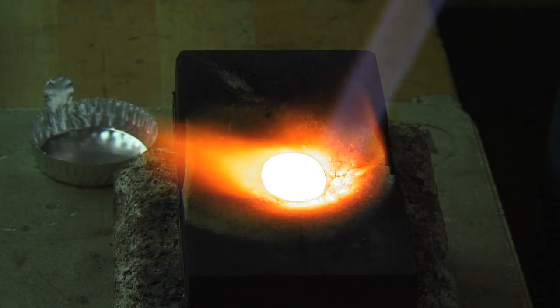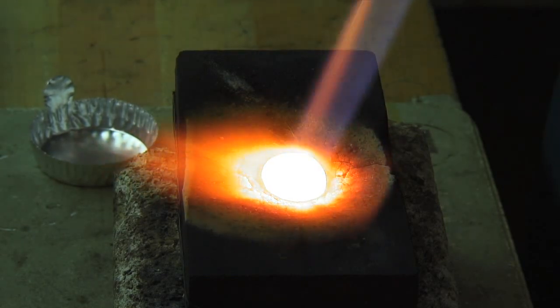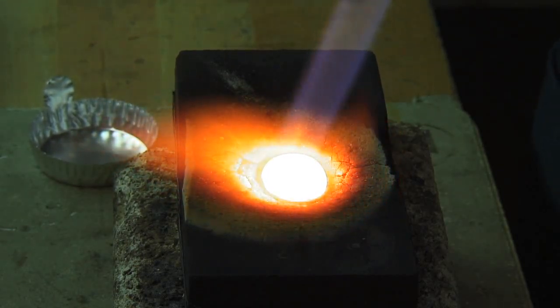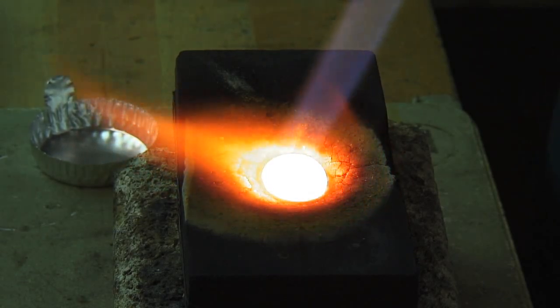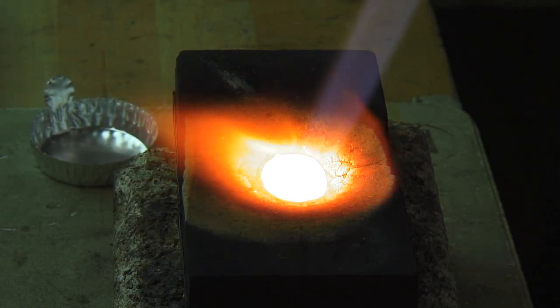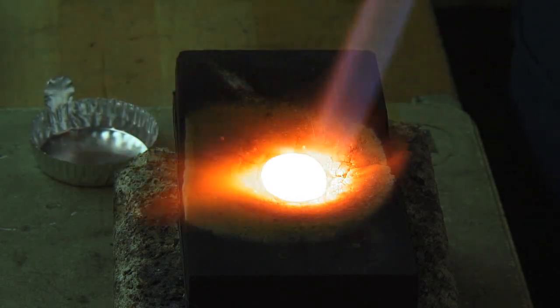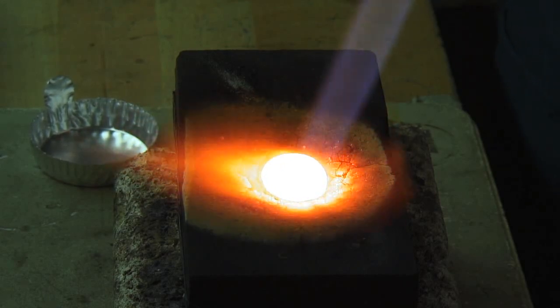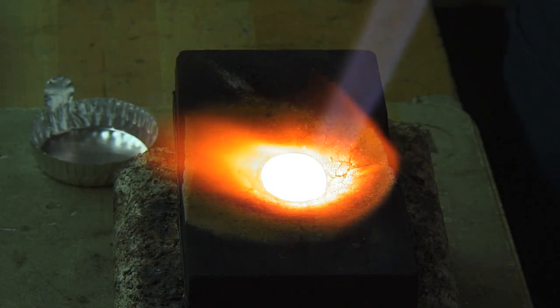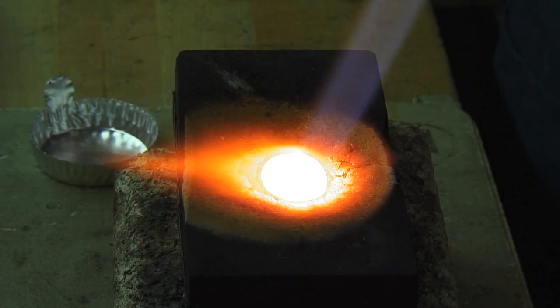It's not enough to look at this metal and say it looks liquid, it must be alloyed. We have to get it up to a nice high temperature and a good yellowy color to tell us that it's actually combined completely molecularly to form a consistent alloy. See how it's getting a little lighter and a little lighter. It's not that the gold will turn pure yellow, but it's going to have a lot more of a yellow light shining from it than just the orange — that's what I'm waiting for. You see the color now, how much yellow light is coming from it besides the base orange? That's how I know it's hot enough. Some people will also use a little chopstick to stir it around, but just remember, it isn't stew. Stirring it is not going to make it alloy evenly — it's the temperature that's going to do that. I know it's alloyed, so I'm going to turn my torch off and let it cool, then throw it in the pickle.